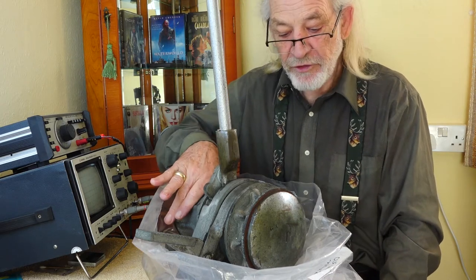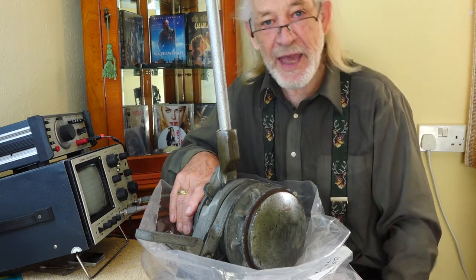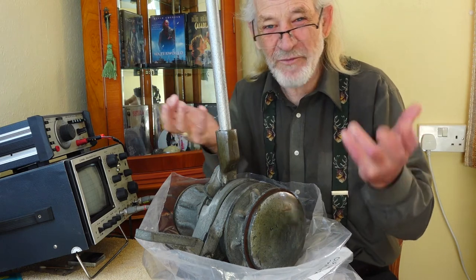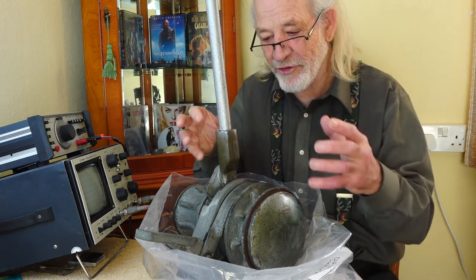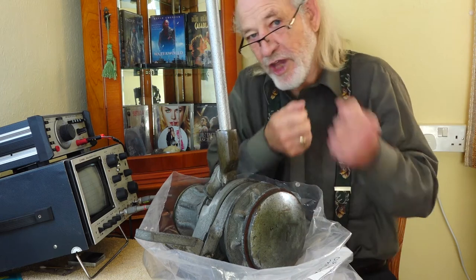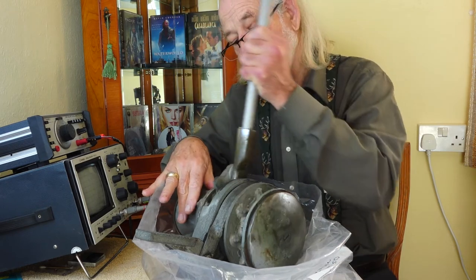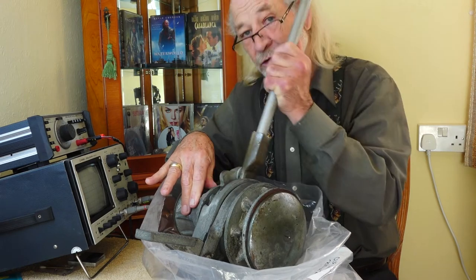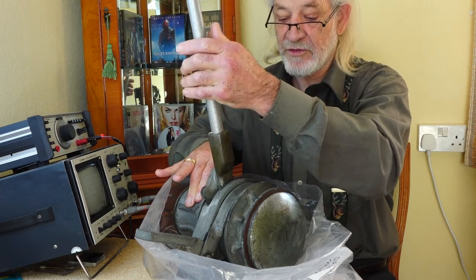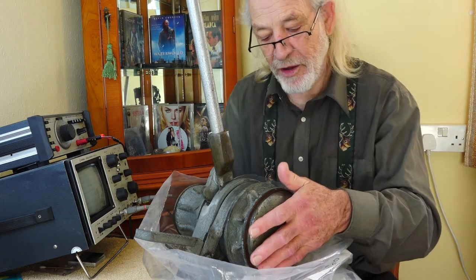It's not really for pulling the whole anchor rode out of the water, though it can help when there's a problem you can't lift manually. For example, your anchor may have attached itself to a big heavy sponge with rocks on it — a huge heavy object you just can't lift any other way. In that situation you can use the winch to get it off the seabed, so you won't be stuck and have to lose your anchor. It's essentially an emergency device.